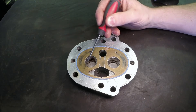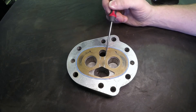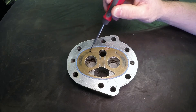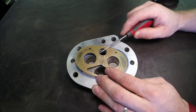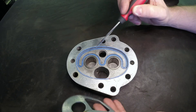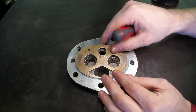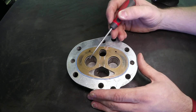As the gears come around, closing themselves off and creating pressure, they force the oil out through this smaller hole into the system. Because of the system restriction, pressure rises and gets through this bore right here in the pressure plate. That hole puts pressure behind this plate, and we can see there's a high-pressure seal pack right here that holds that high-pressure outlet oil. This actually helps the volumetric efficiency of the pump by lifting up the pressure plate and squeezing the external gears between the upper and lower housing.